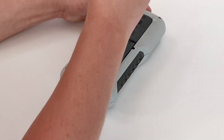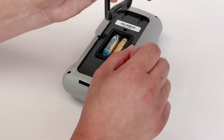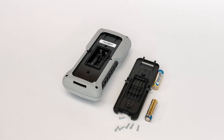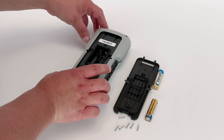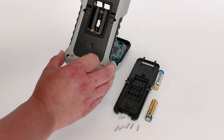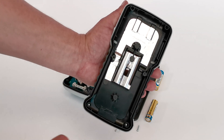Removing the battery compartment is just a case of removing two captive screws with a flathead screwdriver. To get to the fuses you remove the other six screws — just self tappers. As standard it comes out of the box with two AA batteries included. It's good to see threaded inserts in the body, and inside you've just got basic EMI shielding.